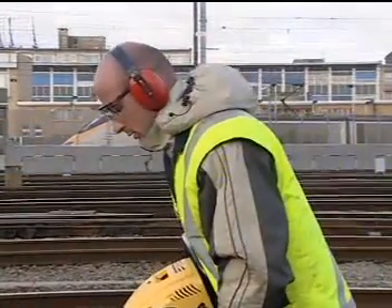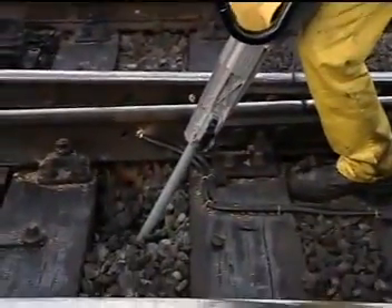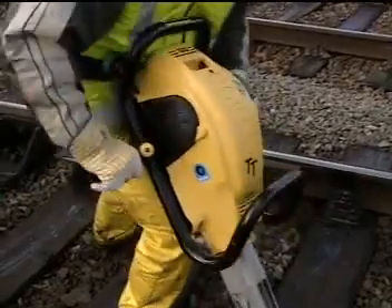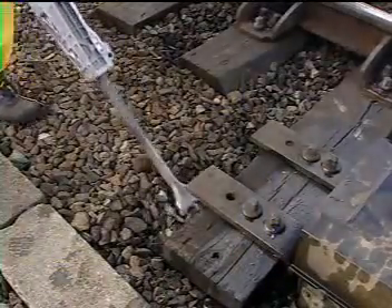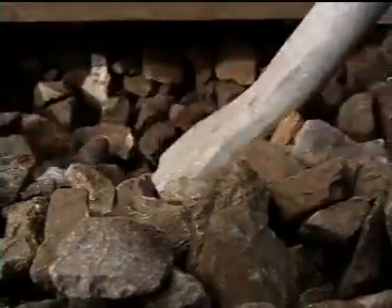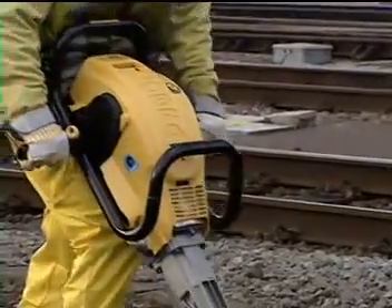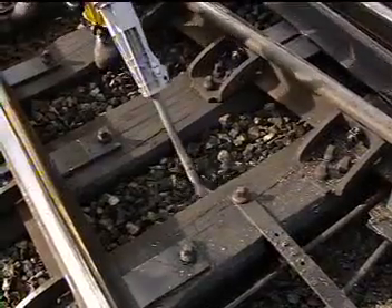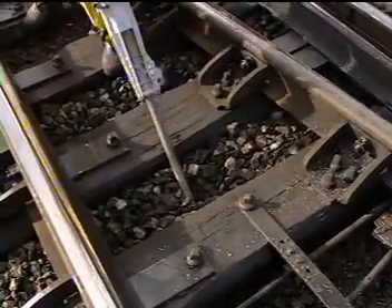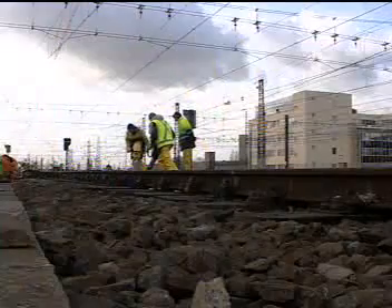To achieve the desired effect, it's important not to work at too steep an angle, because that would cause the tool to go too deep and destroy the ballast platform. The tamper should never penetrate deeper than twice the width of the tool head. This usually means the operator will only tie tamp for about two to three seconds in one place before moving on. This rate is sufficient to create a new platform for the sleeper.